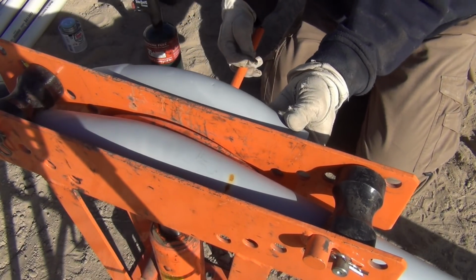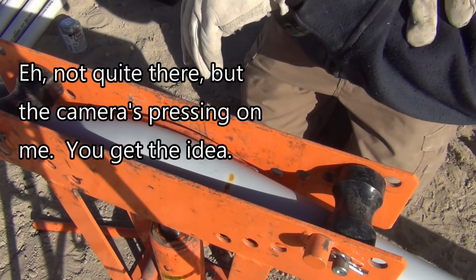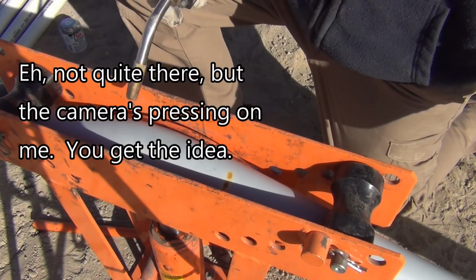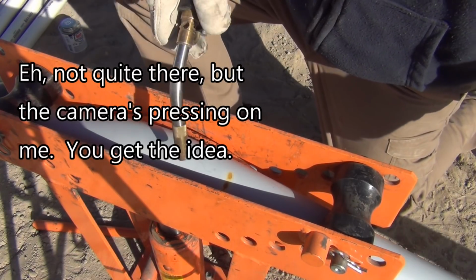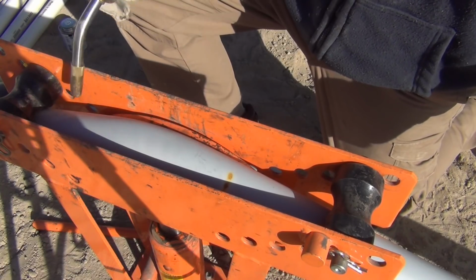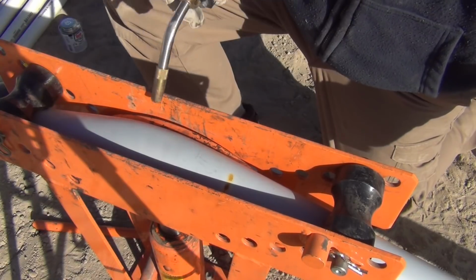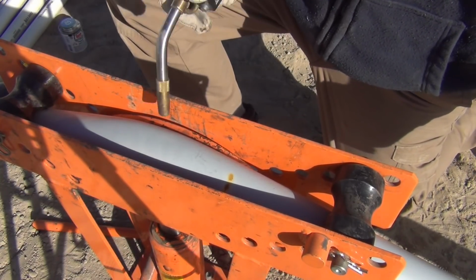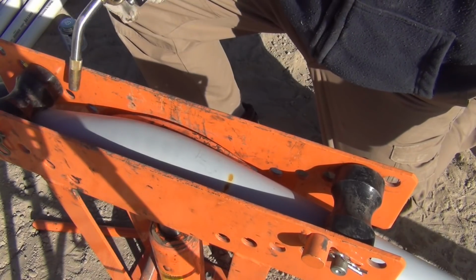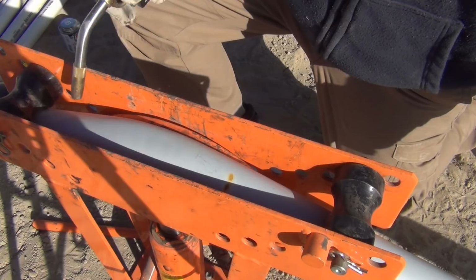And you really fine tune it with a hydraulic jack. So we're there. Next thing we do, look at my watch, I got 40 seconds. What we're doing is we're heating the back side of this so that it can stretch. We're also getting down in the sides so they can relax. And then that'll set our angle. So when you go to feed big heavy gauge wire through this, it's going to be a lot more acquiescent to get through than if you were to do it with a bunch of joints and stuff.